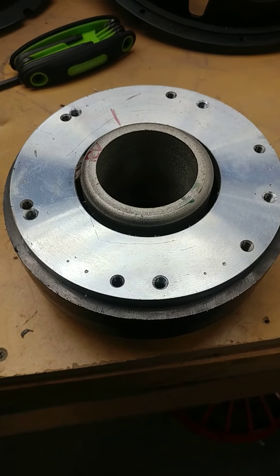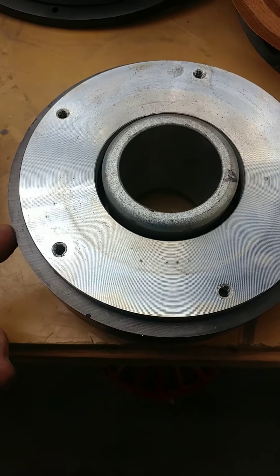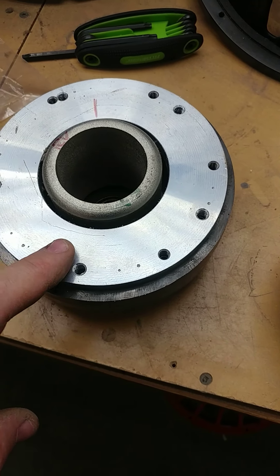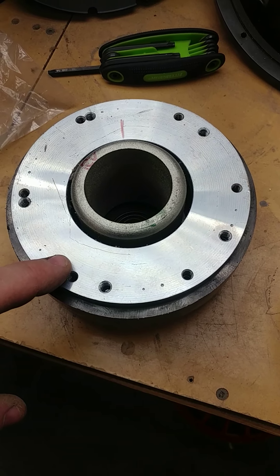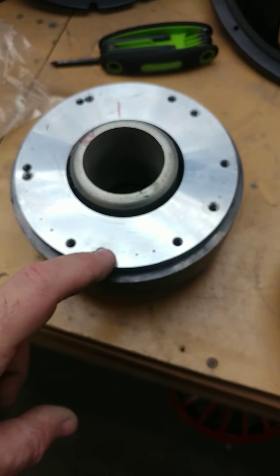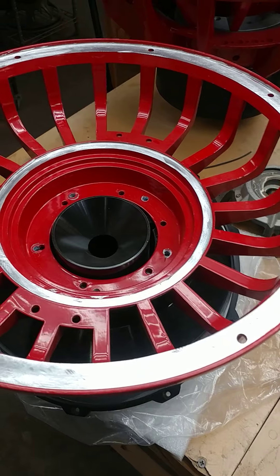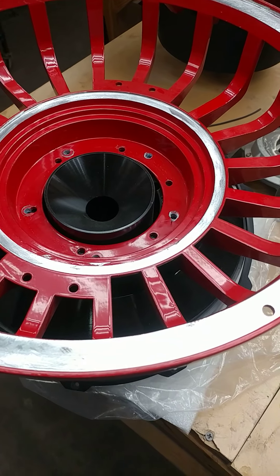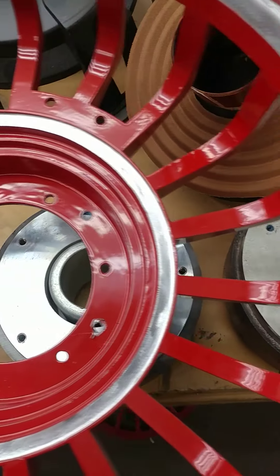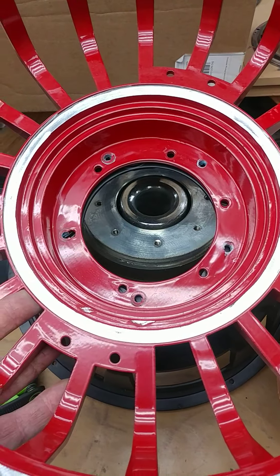So this is the 10 W6 motor — it's a little thing. The 12 is slightly larger in diameter and uses a larger diameter hole pattern for its frame. This one came off, so I went ahead and took it to the machine shop, had to drill it, and then glued it back on so I could use a regular frame. You want to make sure your frame has a large enough base. Sometimes the holes are a pain because JL uses a five-hole pattern, which is weird, but whatever. You put it on the back and transfer the hole pattern.